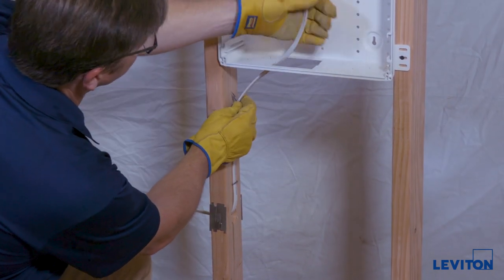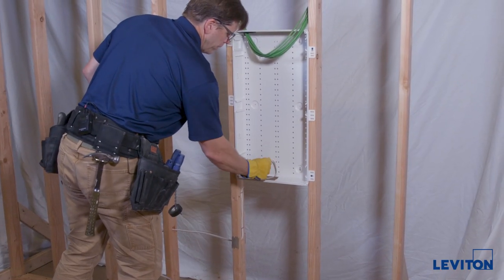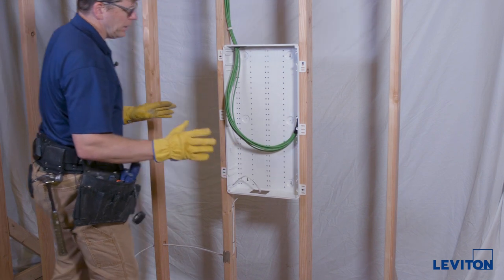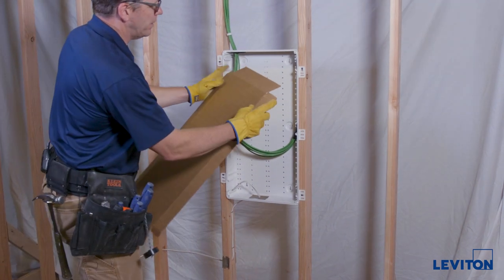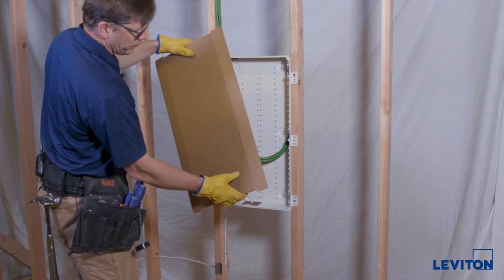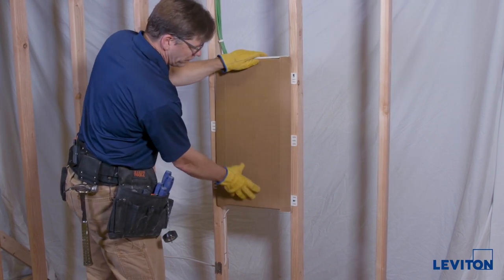You want to leave six inches to a foot of cable sticking out — you'll be able to cut this off later. Now that we have our cable prepared and it's not going to fall back in because we've secured it from below, we'll bring this cable in here and make sure it's not hanging out. Coil it up inside and we're going to put the cardboard mud guard cover in that we saved earlier. It has some flaps on the side — we need to fold these flaps up, square them up top and bottom. These fold in and the assembly pops into the cavity. Then we're going to secure it with some tape to hold it in place, and that will be the rough-in phase complete.